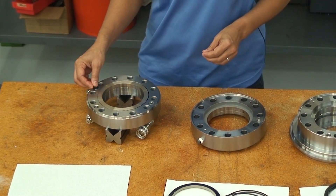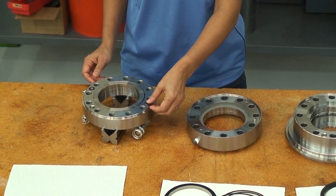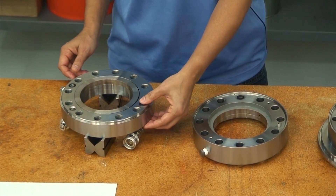These small O-rings conduct pressure between the housings. Their small size minimizes hydraulic area, which minimizes the load on the screws that hold the assembly together.